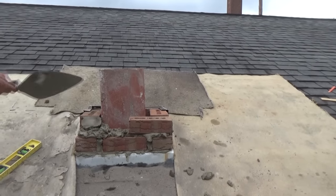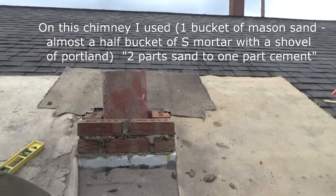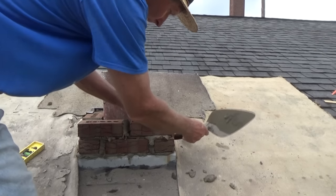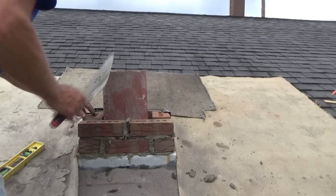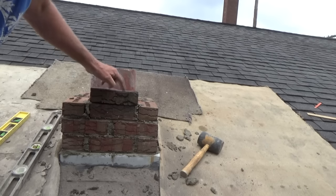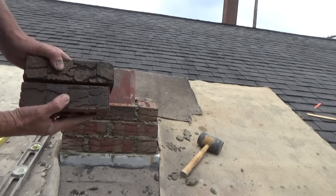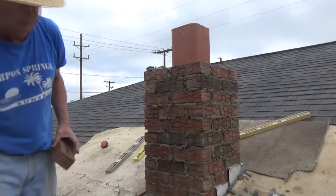How do I know that? I've been doing this since the 60s. See how much bigger the old bricks are compared to these new smaller ones? So I've got to do a little jury-rigging here — bring this chimney in a little bit to compensate. Look at how much difference there is: that brick is shorter than this brick. This is the old brick, solid brick. These are the new bricks — see the difference? I've got bigger joints and it's just barely going to go around the flue. So I've got to compensate. Well, I'm rocking and rolling here — let's keep going up.